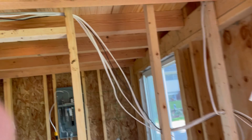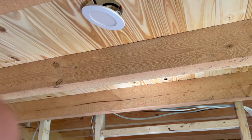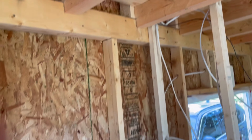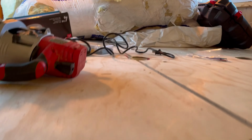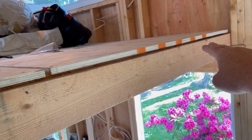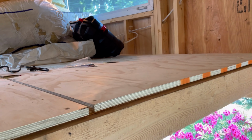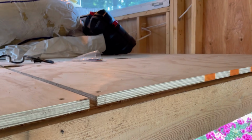What I'm gonna work on right now, there's these pot lights. This one here, pull that one down. And that one here. What I have to do is I gotta wire through, I know this is a crazy video. I'm gonna take this hole here, and I gotta run a wire down this ridge, and then down the ridge here, and to the power, which is right there. And the same thing, I gotta actually router a groove, and then down and over. We're gonna router this groove next.